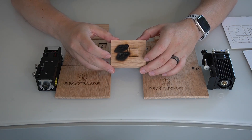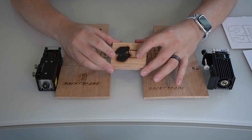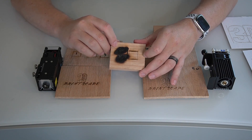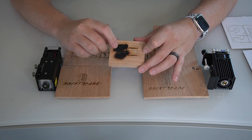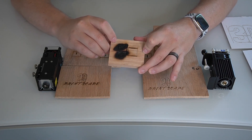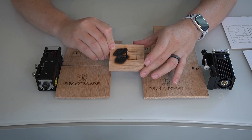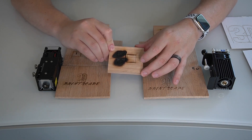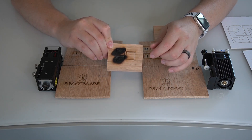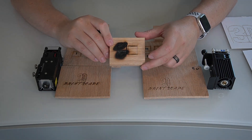One thing I wanted to show: be careful when using higher-powered lasers. I was playing around with the speed — going from 300 to 30 millimeters per second on this board — just to see if I could get a deeper cut in a single pass, and it really just burnt the board. So be careful when playing with settings or materials you haven't worked with before. Make sure you're in the room so that if something goes wrong, you can quickly take action to stop it — because this could have ended badly if I wasn't around.